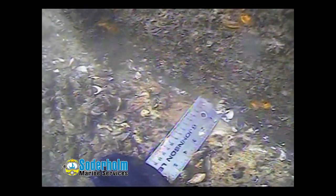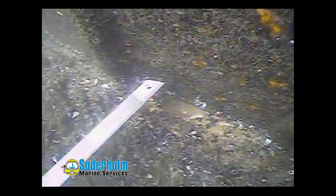Making a round to the east side, we can see there does not appear to be as much sandy material. The gap between the sheet pile and the concrete base is approximately half an inch. I'm able to probe down approximately one inch down into the gap.